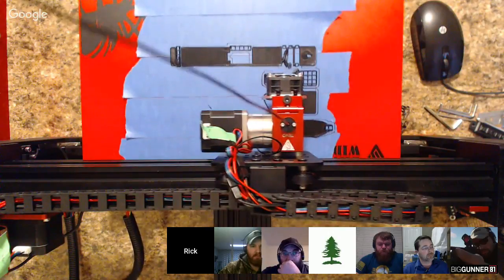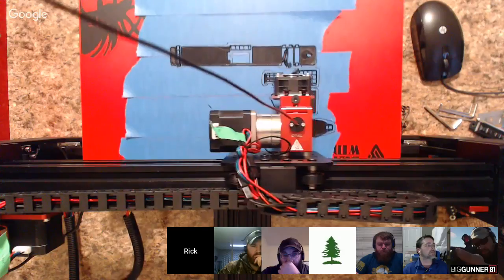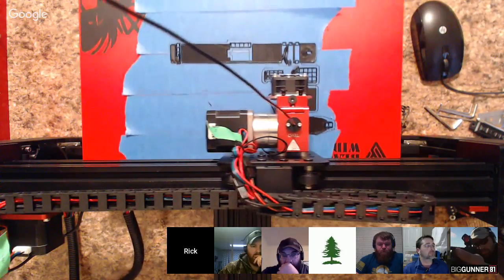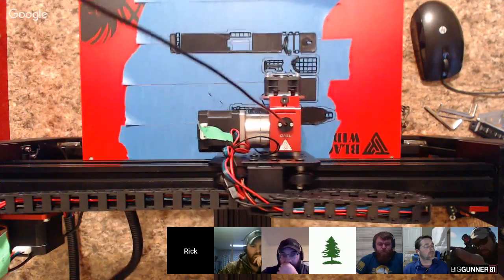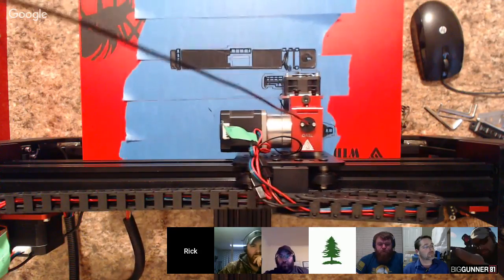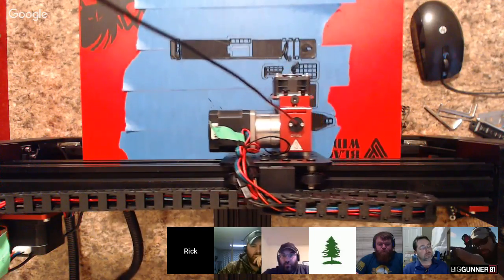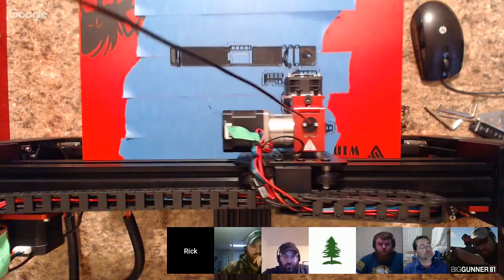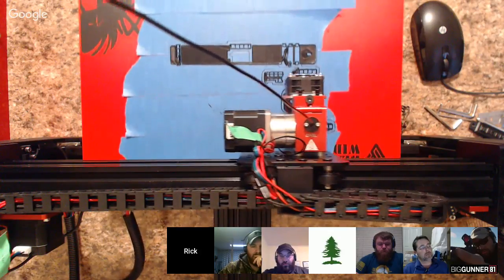It's going to start to build up and fall over, or whatever's going to happen to it, right, as the bed moves. The other problem is if you print it on its side, on any side, it's hollow, so the plastic is warm, so it's going to bow and collapse unless you have support material. Put support material inside of it, it's going to leave behind little rough edges and things like that, so it may not function properly as an actual magazine, but it's worth a try.